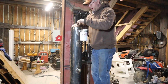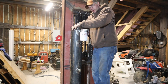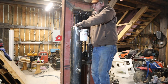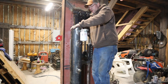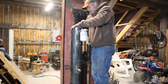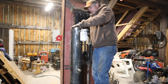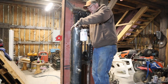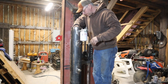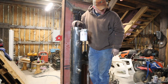The union means if I ever have to take it apart, it'll be easy enough to do. We have a three-quarter inch black iron union, three-quarter inch close nipple on this side, and another close nipple that goes into the back side of this thread protector, threaded in nice and tight. I'm going to want to get rid of this galvanized pipe eventually - it's all I had kicking around, but it's clean inside. I have a ton of three-quarter inch black iron, I just don't have a threader here. To get us running until I get what I need, that's what we're going with.